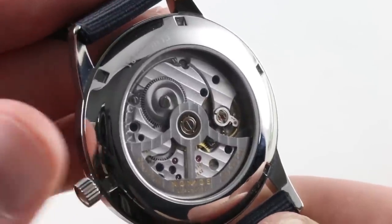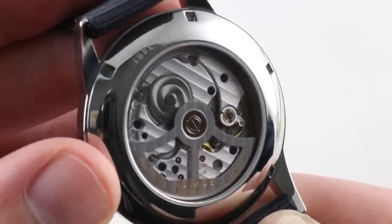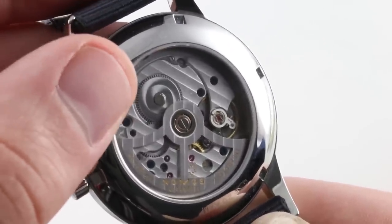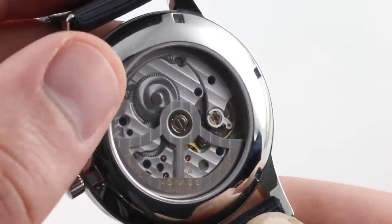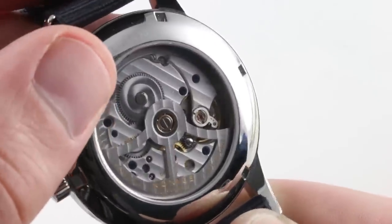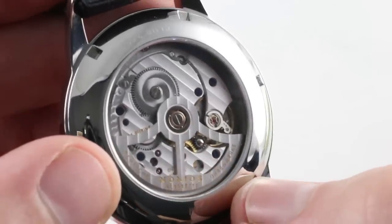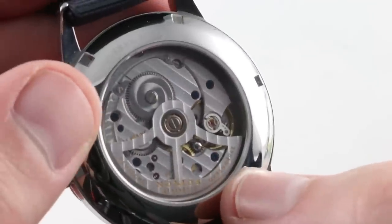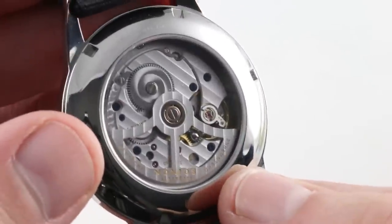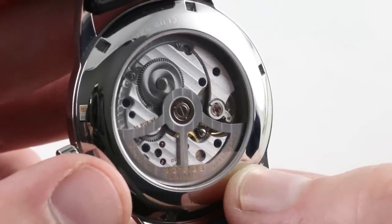The movement is nicely finished. As you can see: Glashütte stripes, because we are not in Geneva — they're not Geneva waves, and we're not in Switzerland. You'll note a double spiral dressage pattern, which is actually laid down by hand. This is one of the elements confirmed as handmade and hand-finished by Nomos — the double spiral is their signature, and they have one guy who does this all day. The screws themselves are the real deal: not oxidized with chemicals, but rather oxidized with heat in a kiln. These are fired cobalt blue screws, not the chemically dyed kind. Nicely made, handsome in its execution and detailing, and entirely in-house in its design and fabrication.